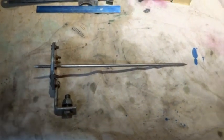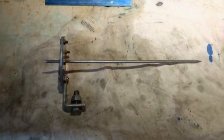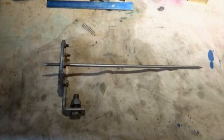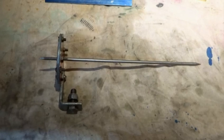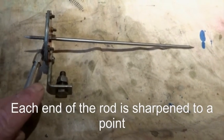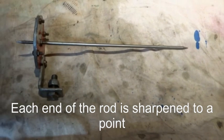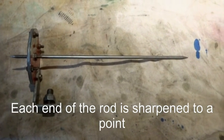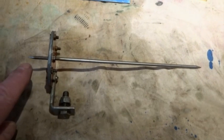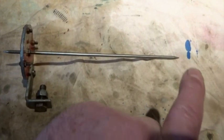I don't think I've shown this before. This little device — very homemade, cost nothing — is what's referred to as a centre finder or a wobbler. The principle is there's a little bit of stainless steel rod: about one inch sticks out this side and in my case about eight inches sticking out the other side, so a small movement at this end if something is eccentric translates to quite a lot of movement at that end.